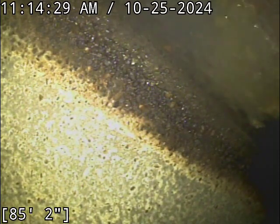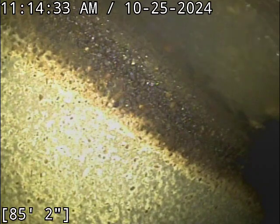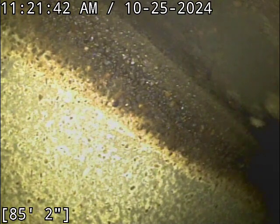We're hitting the main here at 85 feet. We're going to go locate that really quick while the line drains off, and then we'll pull back in. I've got kind of a weak locate signal on the far side of the street. I'm going to pull back closer in, about 30 feet or so — about where the curb would be — and just take another locate.